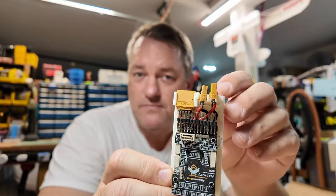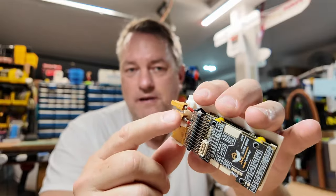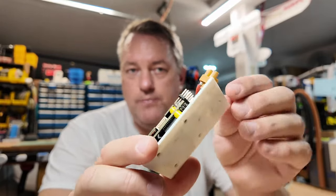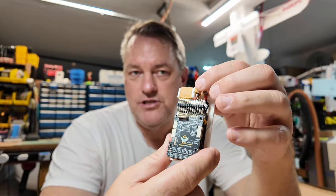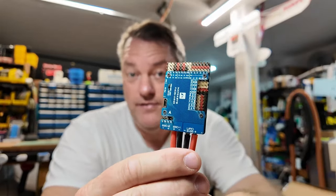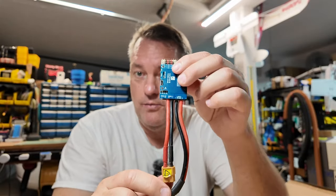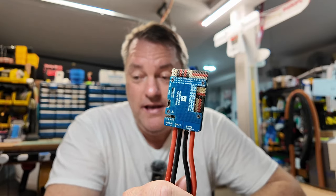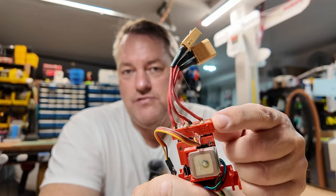Later, as I got into some of my twin-engine designs, here's one out of a crash. The reason for these 3D-printed mounts was that it was easy to mount the XT30s and XT60s, and it simplified some of the wiring. In the event of a crash, the impact was taken by the mount itself — it stood a better chance rather than ripping solder pads out. When the airplane comes to a sudden stop and the battery keeps going, if it rips those solder pads out — which are never designed to be structural — you're done. So I tried different styles and strategies for strain relief.